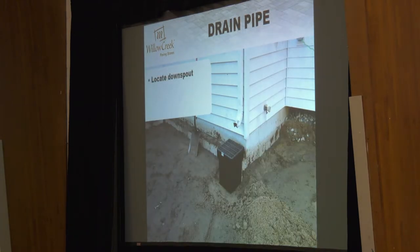We already talked about over-excavating by one foot around the patio. For downspouts, this is one way to do it using grates — but there's more than one way. We actually use an adapter that goes from either a 3x4 or 2x3 downspout into a four-inch round, and we run it straight to a PVC sewer pipe. I don't use corrugated soft pipe under a patio — we've switched over to sewer pipe. It's a little bit more expensive and harder to haul around, but it's more rigid, carries a load better, and increases flow because you don't have those ripples that catch sediment.